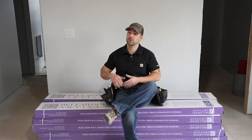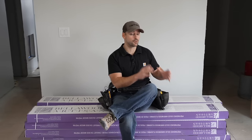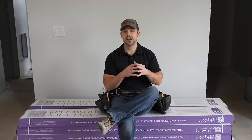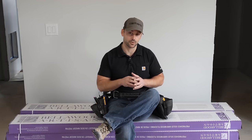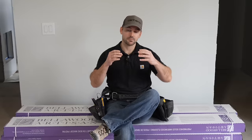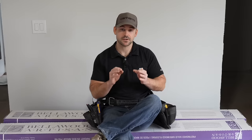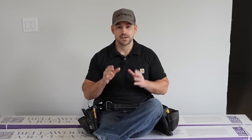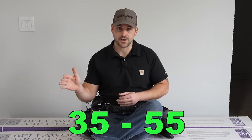I'm sitting on boxes of hardwood floor that's been in this room for over 14 days. I had to let the hardwood floor acclimate to the room first before installing it. Acclimation is when you take the floor and set it into a room and give it time to absorb the surrounding humidity and temperature, because humidity and temperature directly impact the size of the hardwood floor. Let it sit anywhere from 7 to 14 days, preferably 14 days, keeping room temperature 60 to 70 degrees and relative humidity 35 to 55.